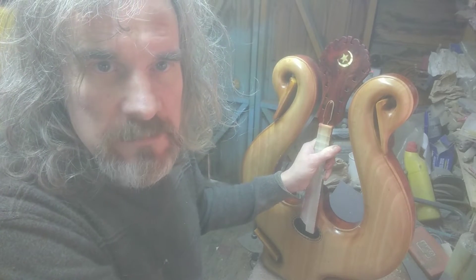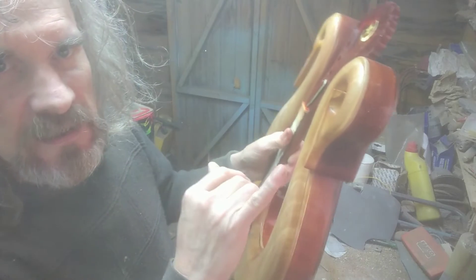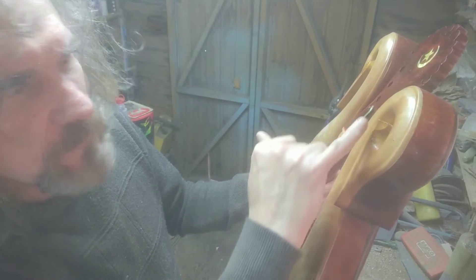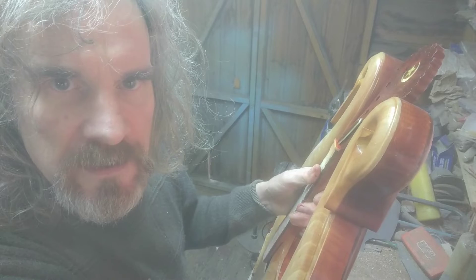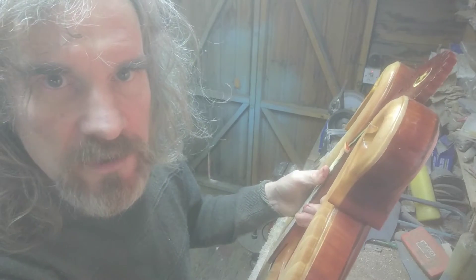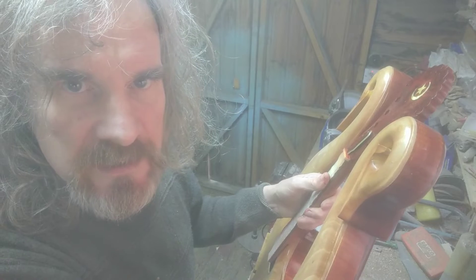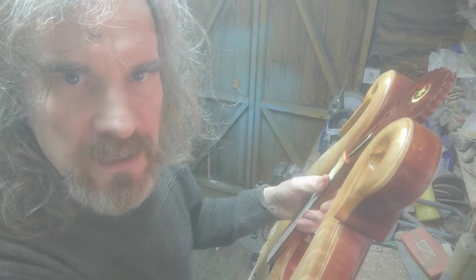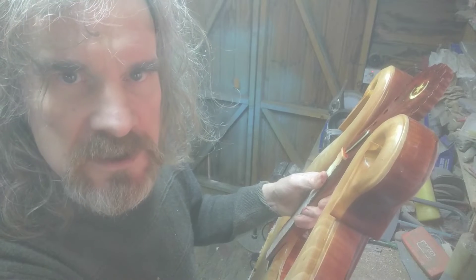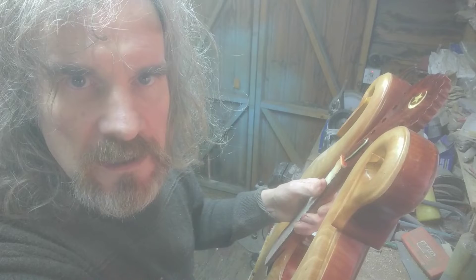I've just been working with my airbrush, basically building up this finish. I just can't get over how gorgeous that came out. It was basically white paint mixed with some yellow dye in clear lacquer. I started off, sprayed that over it, which covered up the filler. And then when that was done, it looked a bit blocky. So then I held the airbrush about nine inches to a foot away from the area and sprayed some yellow — just plain yellow wood dye over it.